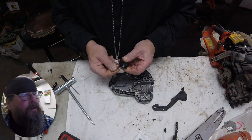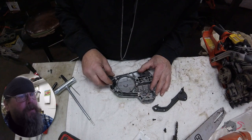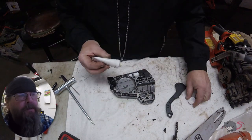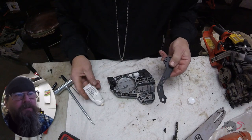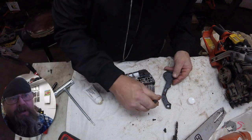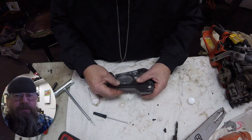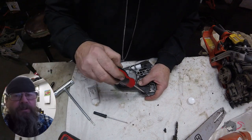There is a locating pin on the cover and you want to make sure that that rubber seal isn't damaged or broken off. It actually locates that cover on the saw, and you want to check the locating hole on the saw and make sure it's not full of debris. If it was packed full of debris and that cover didn't push in all the way, the cover might not sit flush, it might not seal against the bar, you might drip oil rather than pump oil into the bar, and you might have the clutch drum rubbing on the brake band. Just make sure you check that pin.